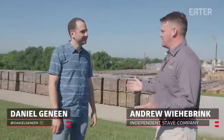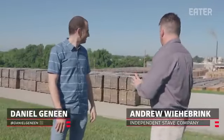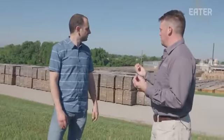So in terms of the cooperage process, kind of what we're looking at here, this is really the first step. This is called seasoning or air drying. Maker's Mark barrels, they're gonna be a little bit different, right? So they're gonna have that 9 months, 10, 11, 12 months of seasoning, right? Essentially, if you wanna put it in a nutshell, you're gonna get a sweeter, mellower, a little bit thicker whiskey out of it.